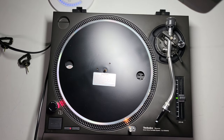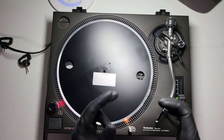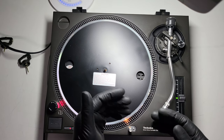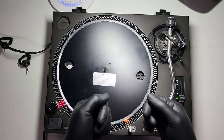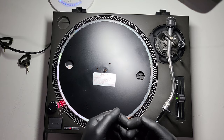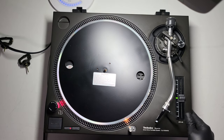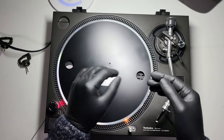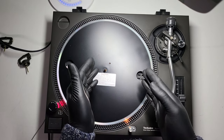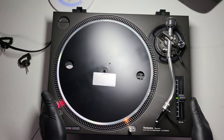Power cables: you've got the European two-prong style going into a bigger UK adapter — very common on later units — and also molded plugs. Replacement screw-on type plugs are fine as long as they've been done properly. If you want to be sure, take it off, cut the cable, strip it down, and pop it back on — wiring a plug is very simple, there are YouTube videos if needed. Make sure with cables you've got no breaks in them — run your hands through the cable, make sure there's no bare wire sticking through. If the sleeving comes off and two bare points touch each other, you're going to be changing fuses at best and possibly causing other internal damage.